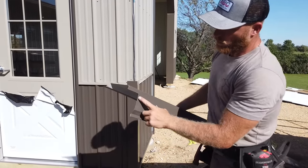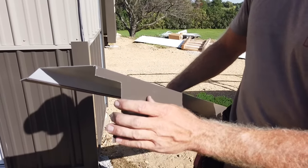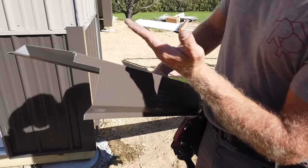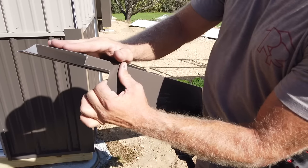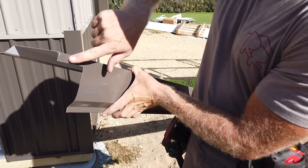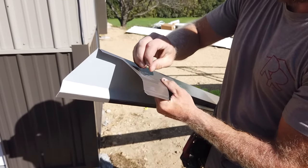There you go — that went in there like butter. Let me pull that back down to pull the plastic and then I'll show you guys what we did on that top trim cut. So here you can see this was the 112 — this is going to go up underneath of your sidewall soffit and tuck into that trim. Then we've got this dimension here that is actually just sticking this out so it's nice and tight up on the face of our gable soffit. And this is what's tucking up into there, basically closing up the hole and keeping it nice and clean. Let's go ahead and put it up there and show you the finished product.